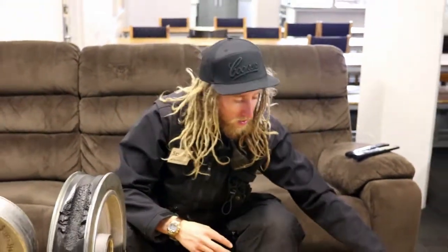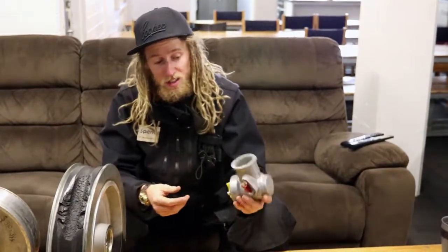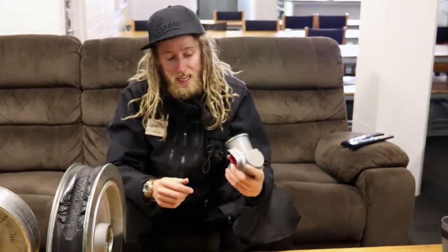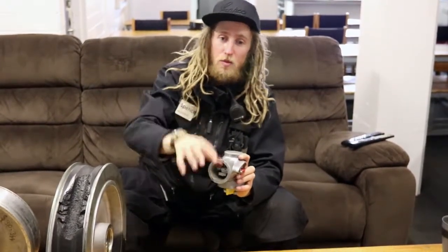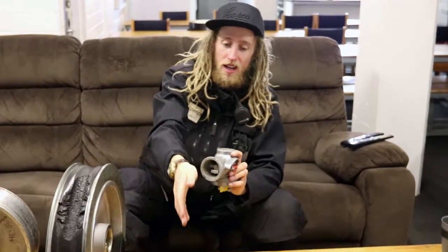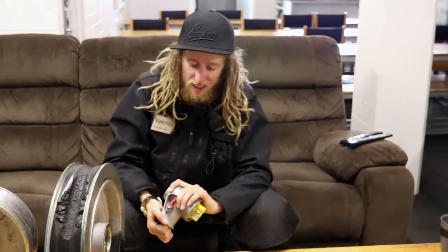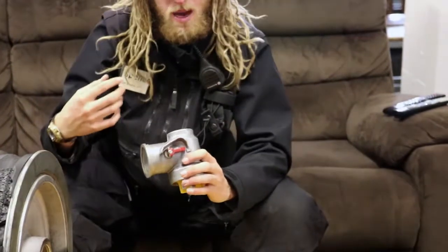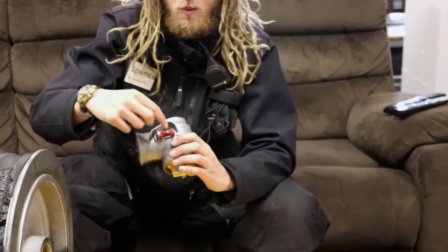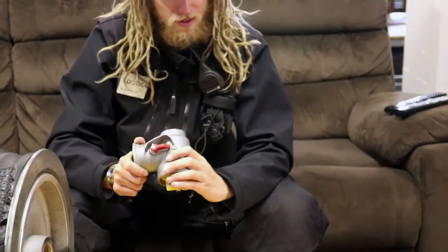The second thing, which you'll see when we're out on international, is this thing here. This is called a spar switch and this will be connected to a little black wheel. That wheel will run along the cable, but if the cable was to fall off or derail, that wheel would fall down or maybe get pulled up and trip this switch here. This is a relatively easy one to fix - if the black wheel were to move, all you would have to do is re-flick this switch here and that would reset any fault we would have on the tower.